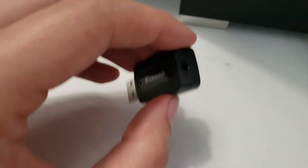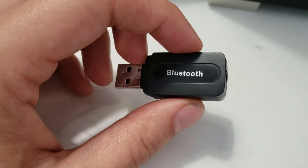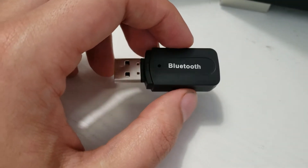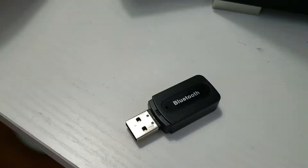The other thing to note is that it's quite noisy. Any noise from the USB power adapter gets passed into the audio output — there's no noise filtering. So unless you happen to find an adapter that has almost no noise, you're going to have that buzzing sound along with your audio.